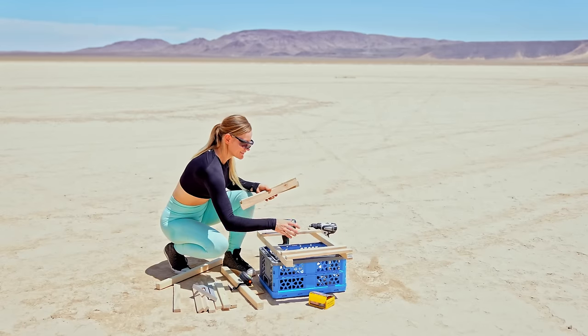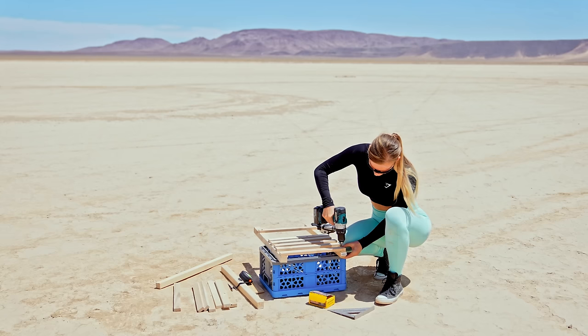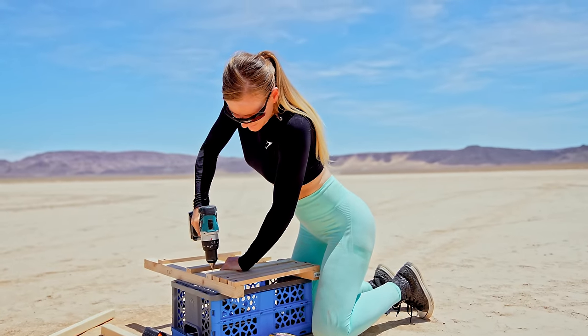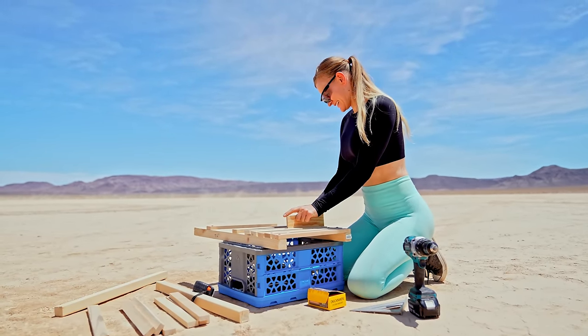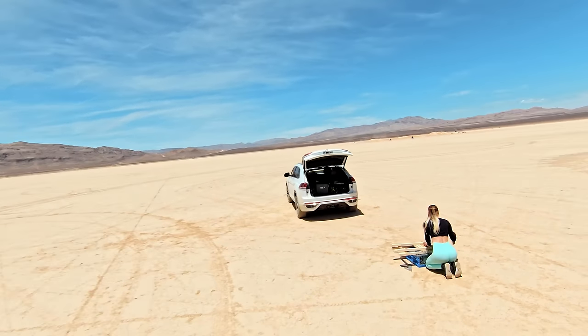This part will be the bottom side of the chair, the piece you sit on. Use 6 of the 15-inch pieces and attach them. To get even spacing, I used a piece of scrap lumber. Pre-drill all the holes and use screws to attach. Be careful when you screw in the screws. There were a few times I went a little bit too fast and the wood split.